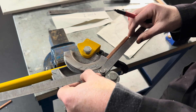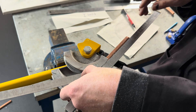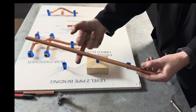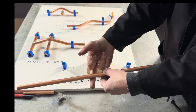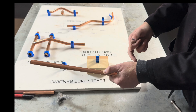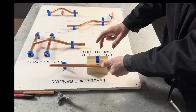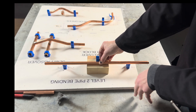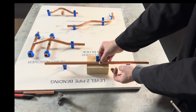It's touching, touching, and it's straight with the pipe. We then do a little mark there — consider that to be a permanent mark, scratch it in. I worked out the middle of my pipe, so I know it's just there — that's the middle there. I then worked out the middle of this, I looked at it. From my experience this would need to be 30 degrees — 45 might be a bit too steep for it to fit in the former.